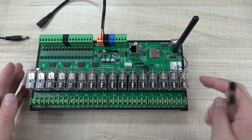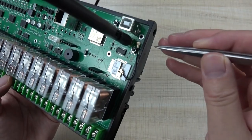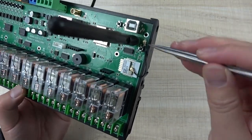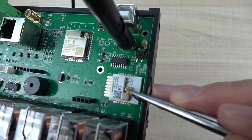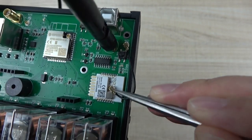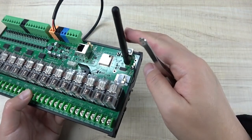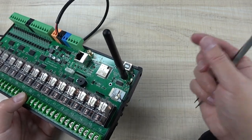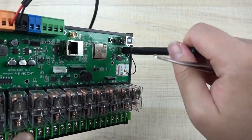For hardware preparation, you need the correct relay first. Second, because we use the Tuya Wi-Fi module, you need to install the Wi-Fi antenna and make sure the IPX cable is connected to the Tuya Wi-Fi module and the PCB. This cable extends the Wi-Fi signal to the PCB board, so you can connect the Wi-Fi antenna to the SMA socket to extend your Wi-Fi signal.